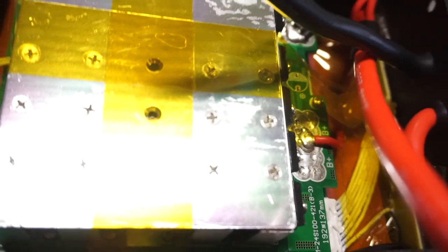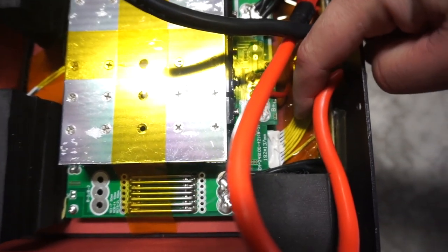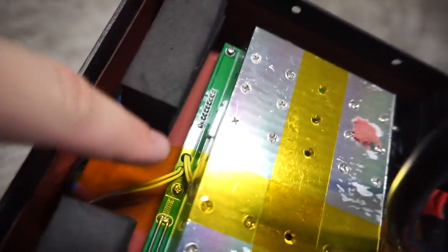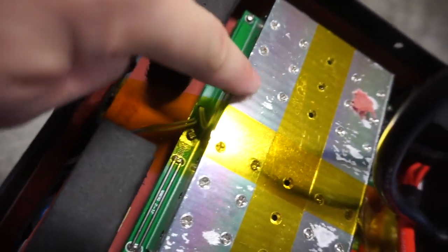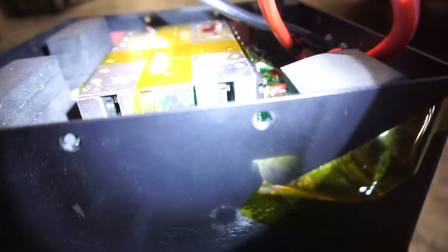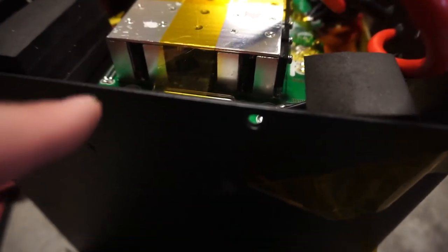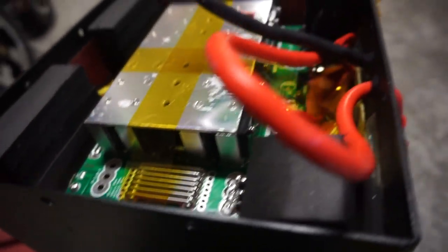I'm assuming these are all current sensing shunts down here. I'm going to scan around this board so you guys can look at this and make your own decisions. I think we've got it figured out - power goes directly to the cells down here. Then we've got all these little sensor cables which I believe are for equalization. Then it looks like we've got some thermocouples - one that goes down into the pack and one that attaches to the side of the battery management. This battery management device is packed completely full of MOSFETs - big, beefy ones. There are four rows of them, and it looks like the controller is set up for one additional row, so we could have five rows.